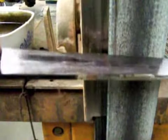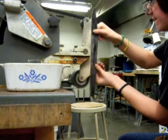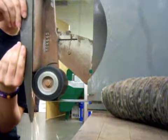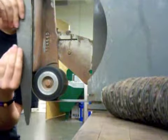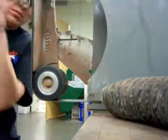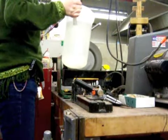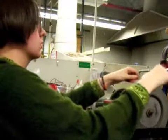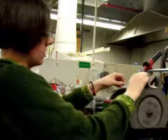Because someone had cut from the same steel block once already, the sides aren't even. To fix this, we'll use a belt sander, which actually cleans up the sides fairly quickly. After the sides are smooth and even, we'll use a hydro grinding wheel to add the dagger's edges. This specific wheel is set up for adding angles — it uses a clamp that holds the blade at specific angles. It's smooth, precise, and also extremely slow.